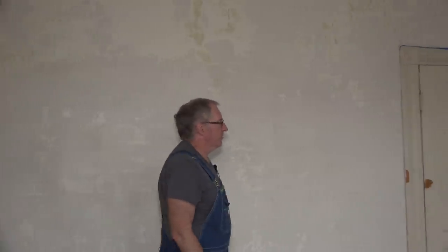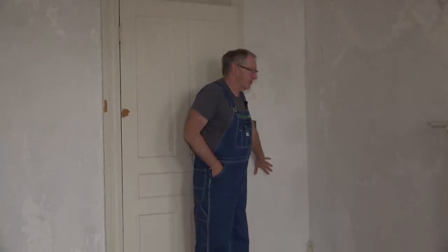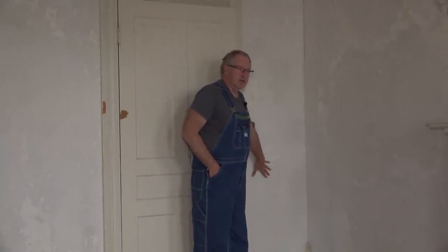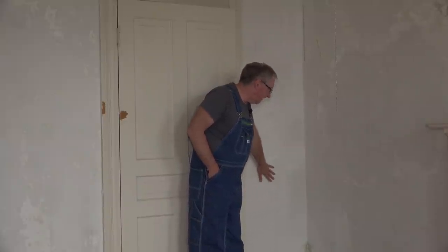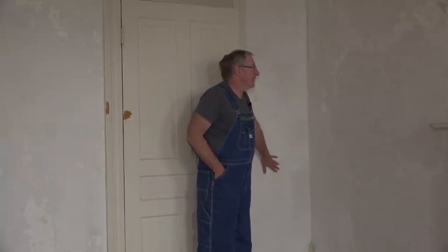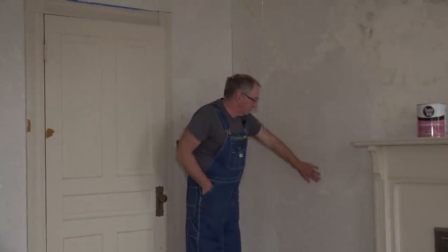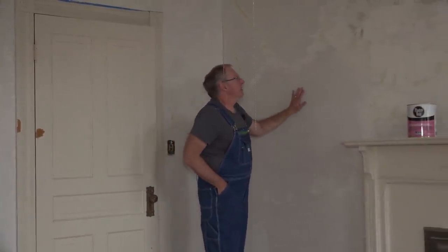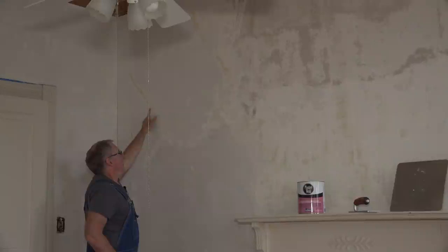If you'll follow me over this way, this section right here was done in the same thing, base coat, top coat, but we didn't put any water on this section, and therefore it didn't bring anything up from below. Whereas it's not too bad, it's still not perfect white. And then yesterday we did this, and this is pretty much okay for the most part, but still not perfect. And you can see here where an old crack was, and whatever compound they used to patch that crack is bleeding through. So we have a serious issue here.